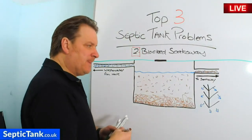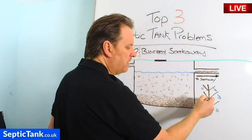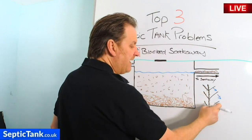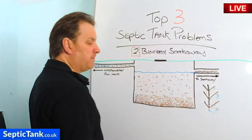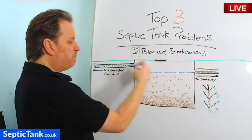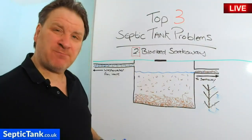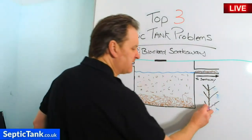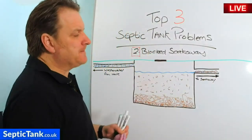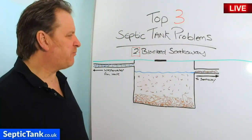But what happens, as I said, is all the fat and the grease and the sludge clog all these arteries up here, right? And basically the liquid can't soak away anymore, all right? And once they're all clogged and blocked up, the water then stops there. It can't leave the septic tank anymore. And then it backfills towards the house. So that's the second biggest problem people in the UK face with septic tanks. The soakaway of a septic tank typically has a lifespan of something like 10, 15 years, depending on how many bedrooms are on the property.